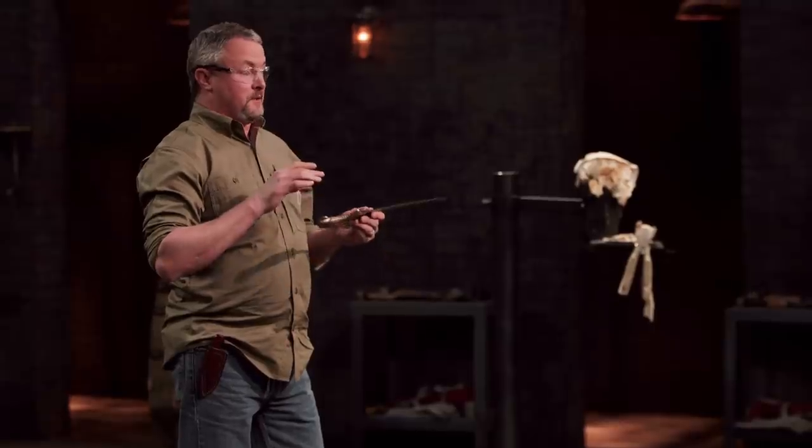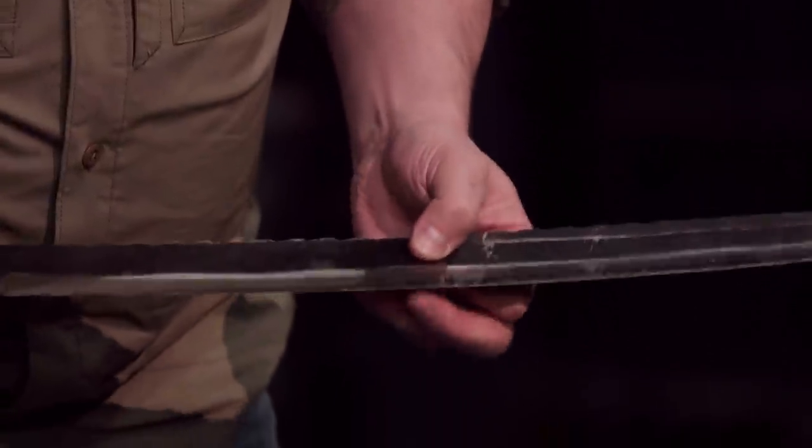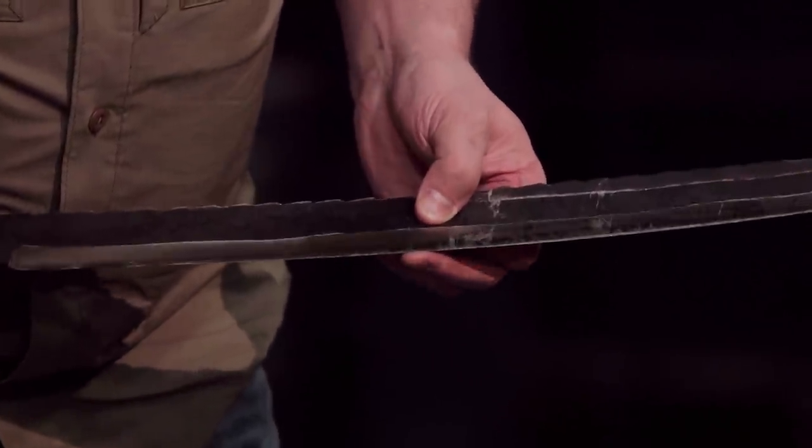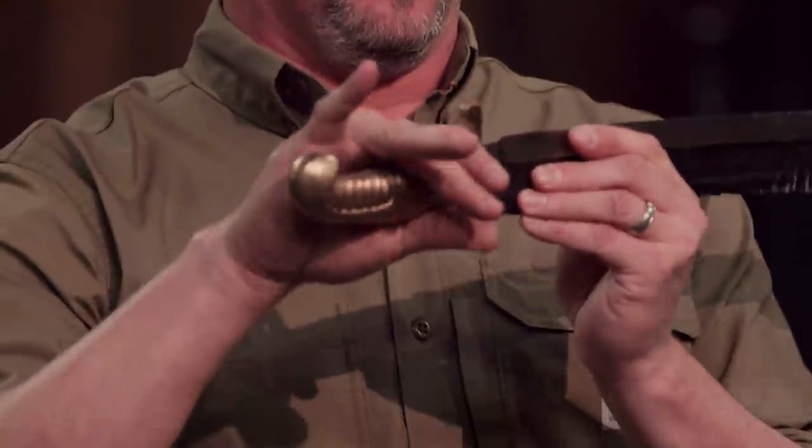Nicholas, this was difficult to control — it's very forward heavy. You got chipping on the edge in a couple spots. The real killer for me, though, was the seam in your handle. This right here is sharp. Most of your control is in these three fingers, and these two are getting cut into. So the handle's a problem.